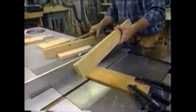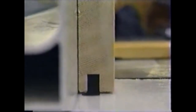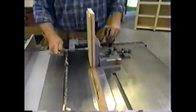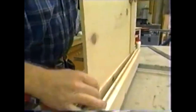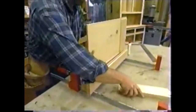Now for the doors — starting with the lower doors. The first step is to run a groove in the rails and stiles to receive the panel and the tenons from the rails. I have the stacked dado head cutter set at three-eighths width, half-inch high, with a feather board to keep the stock against the fence. Then I'm making several cuts to form the tenons on the rail ends, including cheek cuts using my tenoning jig, which holds the piece safely. With glue in the groove where the tenons sit — but no glue where the panel goes, which is just a piece of three-eighths-inch pine — we'll clamp it up.